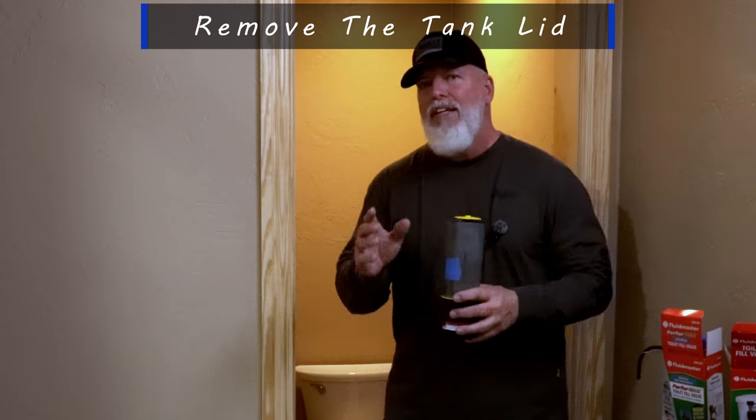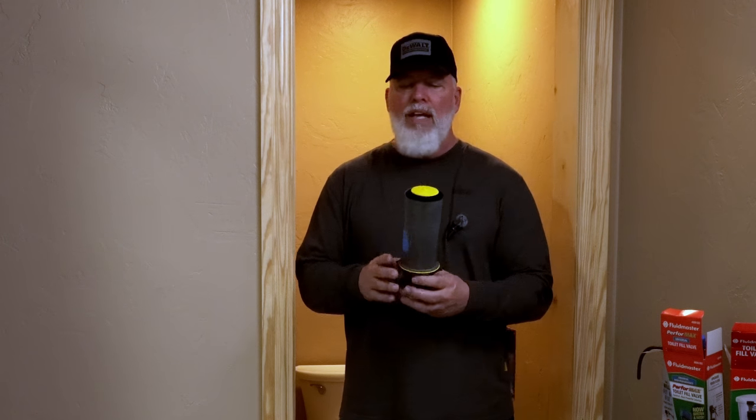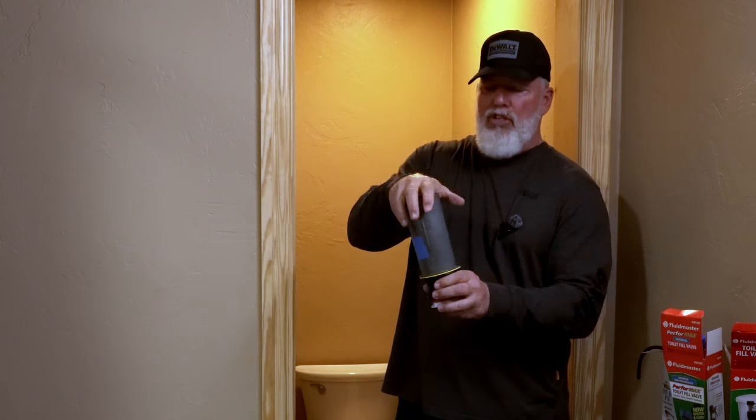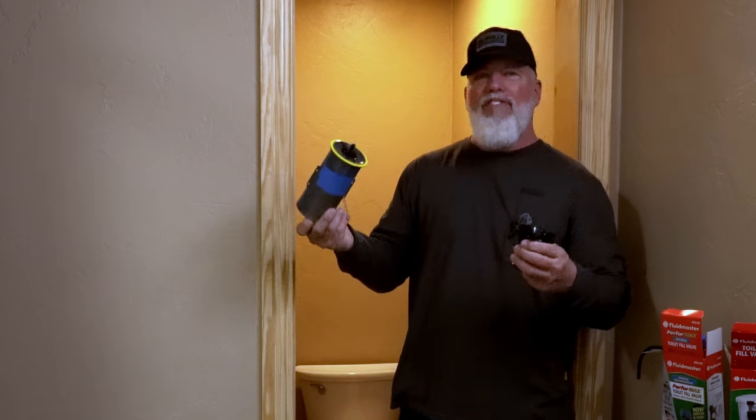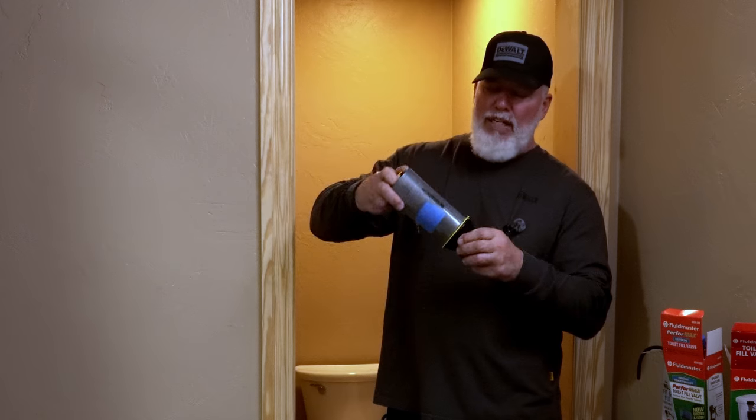That's really all there is to it — the hardest part is very fast. This flapper only costs six dollars and fifty-eight cents and I can change it out in under 60 seconds. When it comes to the canister, you take the back of it off. People are intimidated by the canister if they're used to flappers, but it's easy: unplug the hose going into the center, twist the canister, and pull it off. To put it back, just drop it in and turn.